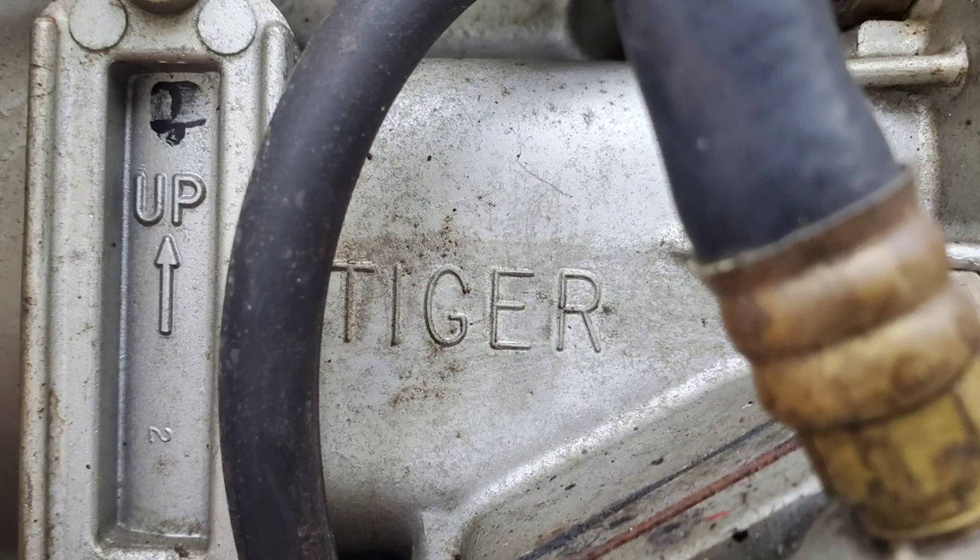So that's signs of a healthy switch box. I just thought I'd take some time out of my day and show you what I'm dealing with. I'm working on a 950SS right now on a Tiger — it's a 90 cubic inch block, really beautiful. Great compression, around 140–150 PSI on all six cylinders. And right now I just got no spark on all cylinders, so obviously I got a bad switch box.